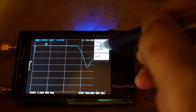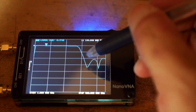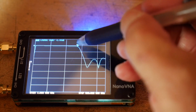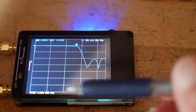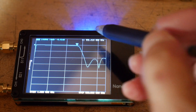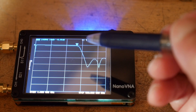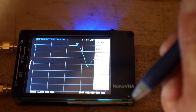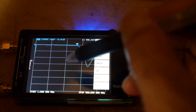If you want to look at it in linear mode you hit the Linear button, and then you can see it in a little more detail. Going back to log — here's our log magnitude for S21, labeled as channel one log mag at 10 dB steps. We can take our cursor and put it right on the corner — it's measuring 550 megahertz, and about halfway down it's around 620 megahertz. We measured this on the HP equipment too and it measures about the same. The filter is marked 400 to 470 low-pass on the board, but it's actually up around 550. Anyway, it is a nice flat low-pass filter.